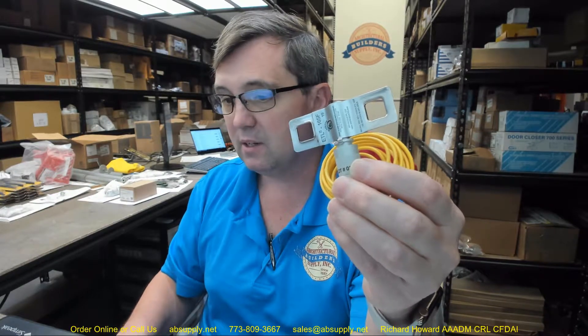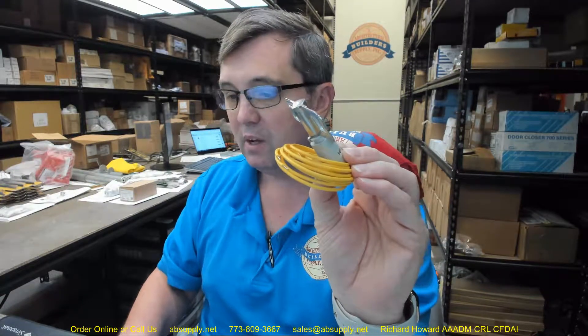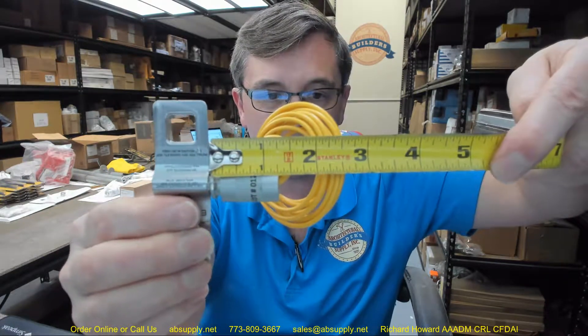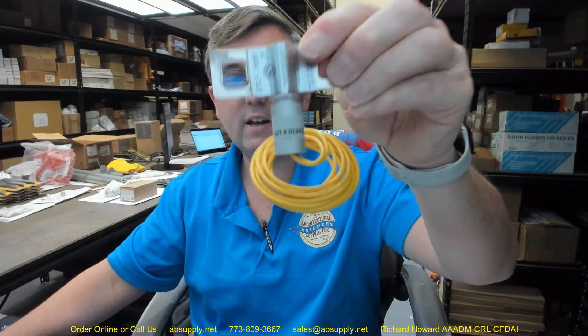Now looking at the extended description: multi-purpose dual responsive fusible link release device designed to substantially improve life safety and minimize property damage, because you can initiate upon receipt of an electrical charge. It creates an instantaneous fusible link response and separation in the event of a fire. The ETL has a protruding cylinder to house the heating element and attachment wires and to provide a means to attach a standard EMT conduit connection adapter. The overall length of that cylinder is about 1 and 1/4 inches, with an OD of 0.69 inches. The lot number is also printed on there.